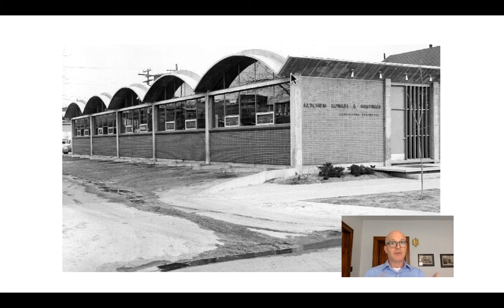It wants to take not the vertical load of the vault but the horizontal tendency for it to flatten out — the horizontal reaction. You can see that this vault is perched on top of simple columns, which are providing simple supports at the ends of what will be beams.